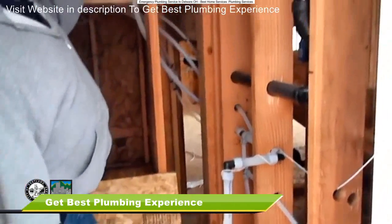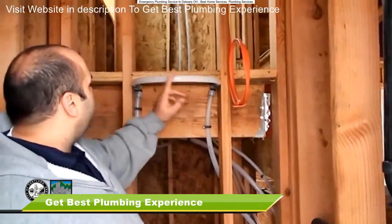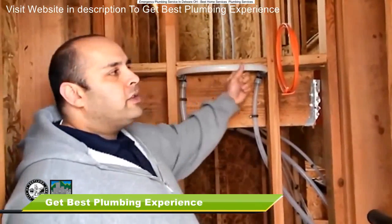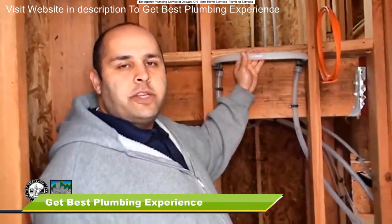Then up here we've got our water heater loop, so the cold water comes in to feed the water heater, and then we've got hot water going out. But because we have to test both sides of the system, they make a loop like this so we can tie into it, to tie the two sides together so they can fill both sides for our test.